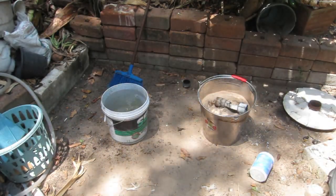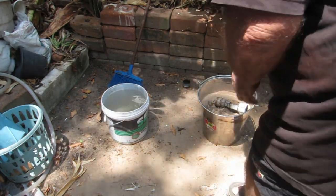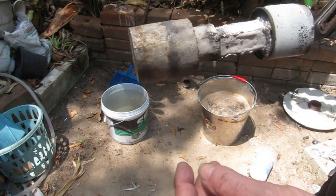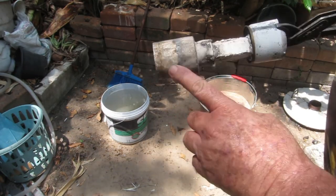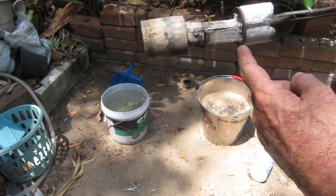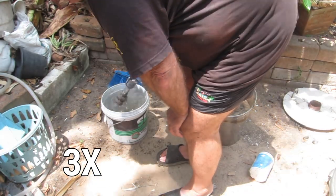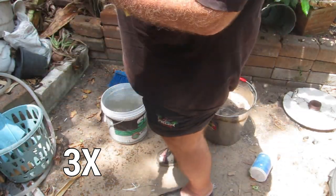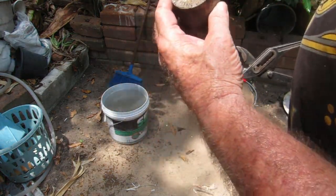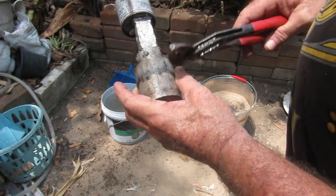This one started to form up and then just stopped, but luckily the one that matters seems to have formed up alright. As you can see, the finish on this is much better than I used to get with that heavier sand. I'll go and quench this and we'll have another look. It's come up fine — absolutely nothing wrong with that. That'll be perfect for what I want. I'll cut that sprue off and we can get into machining it up.